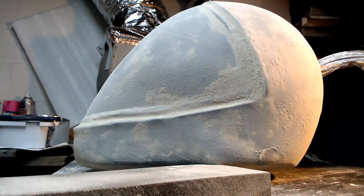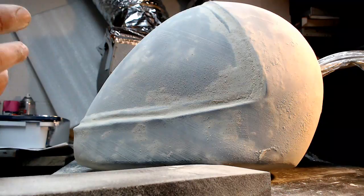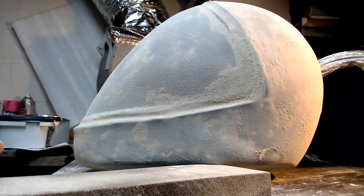That stuff's like super thin. If it's a quarter of an inch thick, and I know we're talking 3D printing and I'm talking inches, but even a quarter of an inch thick is the thickest it gets. It comes just like a roll of duct tape, 2 inch wide strips of it, and you put that on the bottom of your bed. Even without an enclosure, you can get it up to 100 degrees, no problem.